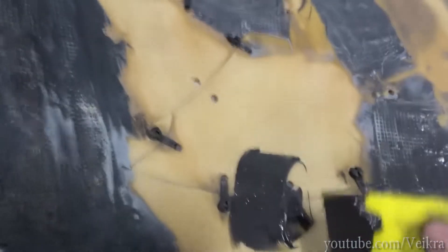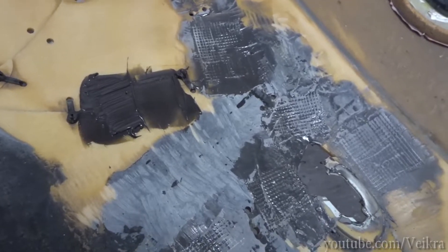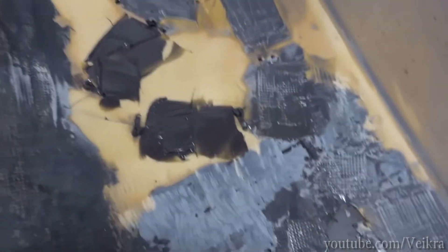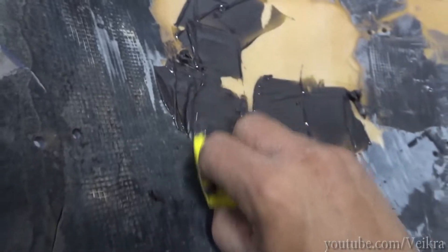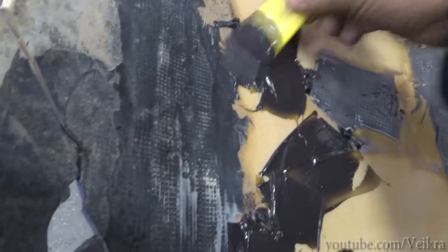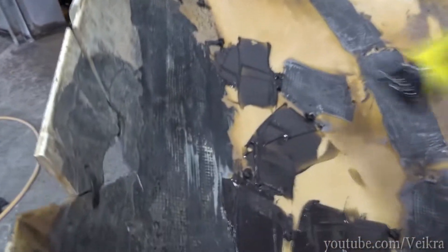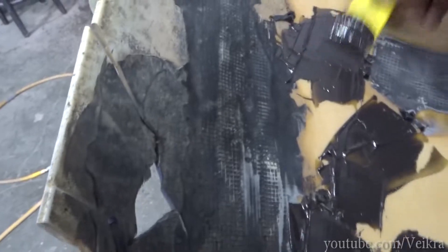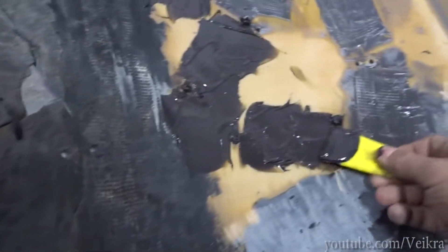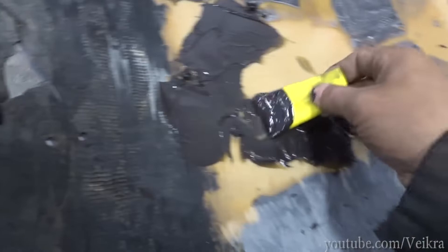Now we've got the glue, and as you can tell it's very whitish because it's sanded down and free of grease — or I should say wax, because it is basically wax. They put the wax inside the plastic so they don't have to prep the mold every time they want to print a fender — they just keep printing, pop it out, cool it, pop it out and start over. It's very cheap to manufacture once you've got the mold — much quicker than fiberglass, where you gotta lay it in and use vacuum. This process is much simpler, and that's why they went with it — to make the truck as cheap as possible and sell it to you for 90 grand.